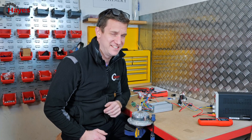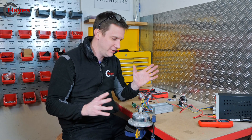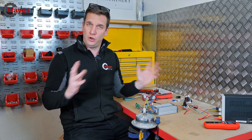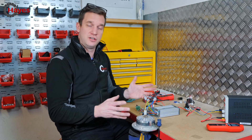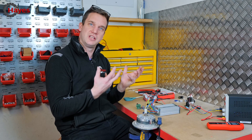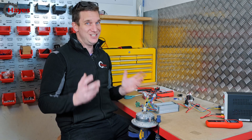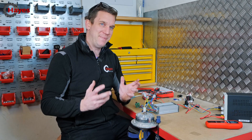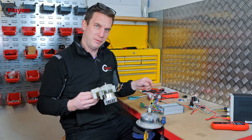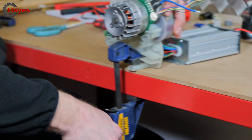After some intensive research, I worked out what's going on. This motor is a brushless motor — very nice, it's got three leads coming out of it — but it doesn't have hall sensors. You need hall sensors to control the speed easily. Those little cables allow the motor to talk to the motor controller and tell it what it's doing and where it is. This motor is not going to work. Bad news — but good news: I've got another motor and it's got wires for hall sensors. My problem is I've got five wires on the hall sensor here and six wires on this one, but we'll work it out.